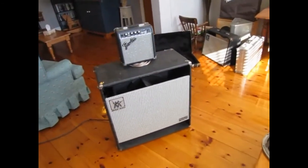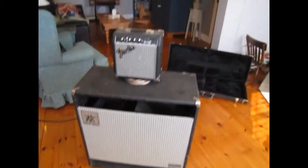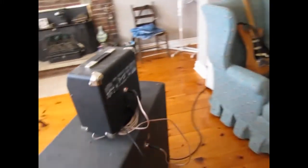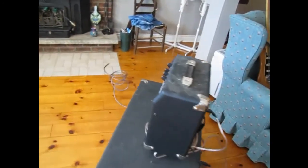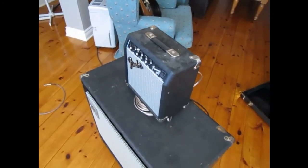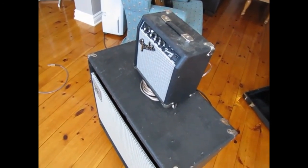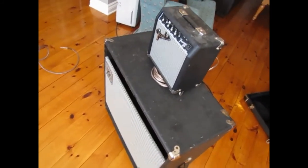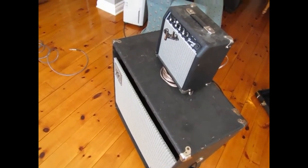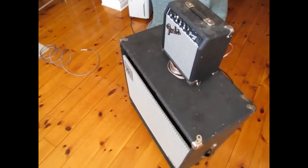As the cabinet has no amplifier internally, it just has the old two wired parallel inputs. So I drove the demonstration just now with a little Fender practice amplifier. The Jensen original speaker inside the cabinet is only rated for 25 watts, so you can't really drive this cabinet with a very powerful amplifier — it needs to be run gently.